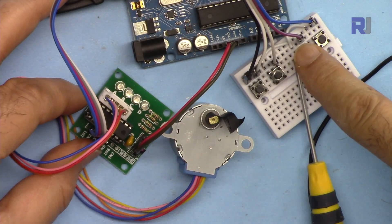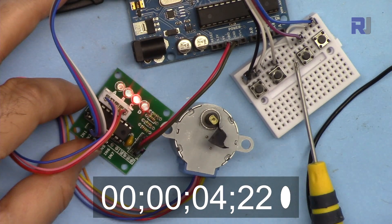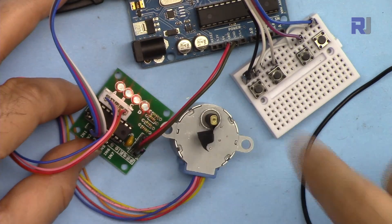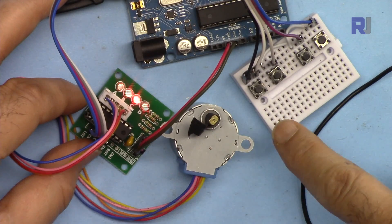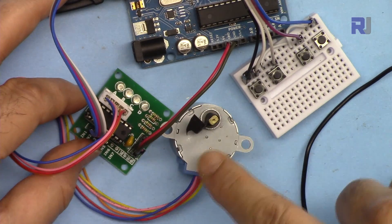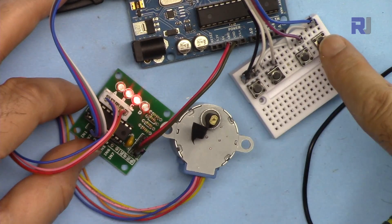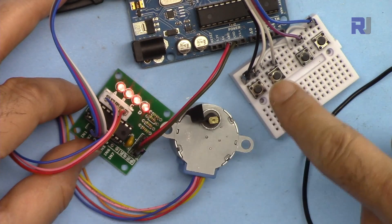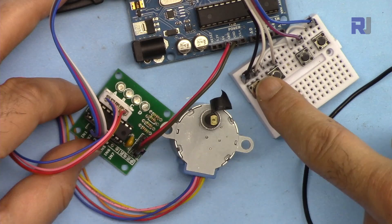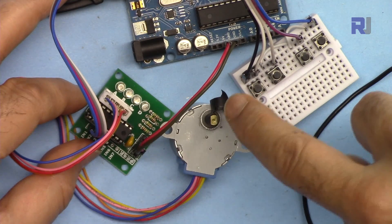The code is uploaded. Pressing this button, you can see that 90 degrees is taking much longer. Pressing it again, it continues from that point. If you want to put the motor in a specific position before sending it to another angle, you can press a button, stop it, and manually get it to the exact location you want — we call this the home position.